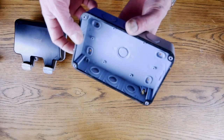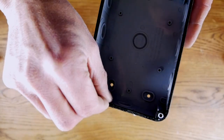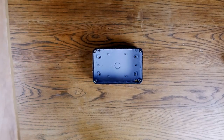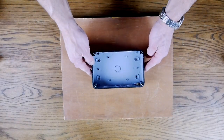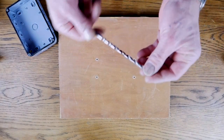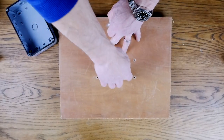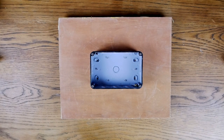The first thing you want to do is drill a 4mm hole in each corner where the screws are going to fit through and go into your wall or wherever you're going to fit it. Then you offer it up to where it is going to be fitted and mark a hole through onto the wall or board. Use your masonry 6mm drill bit to drill those holes, then insert the raw plugs that come in the pack, and simply screw your screws through the case and into the wall for a very solid secure fix.